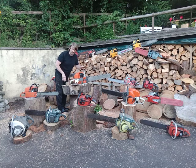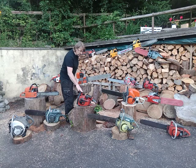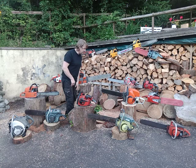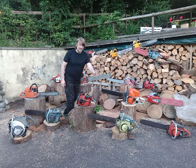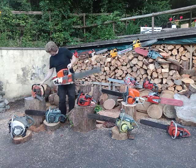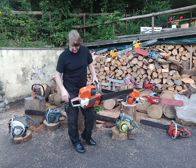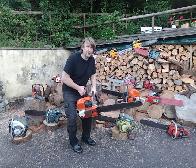Again, she's out because she kind of mirrors the time frame for these saws. So mid 70s. That's her smaller brother. Interesting, their piston sizes then. 52mm. The 92cc Solo is a 54mm. The Pioneer 650, 103cc, runs a 57mm piston. The Solo 60142, careful, the 60142 is a thumper, and these run a 58mm piston, 160 displacement. I haven't shown a video of this girl yet, but yeah, she's a frightening creature.